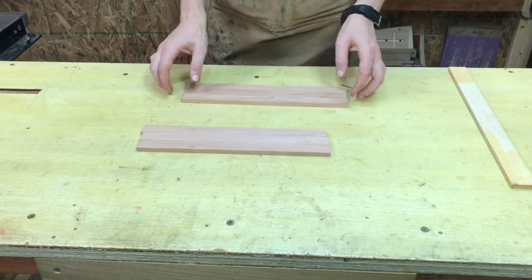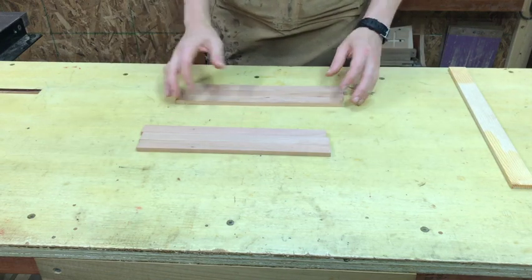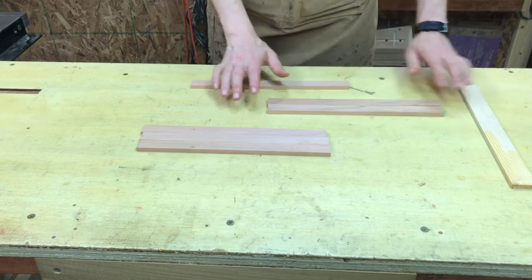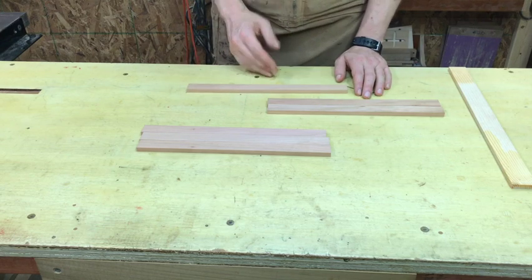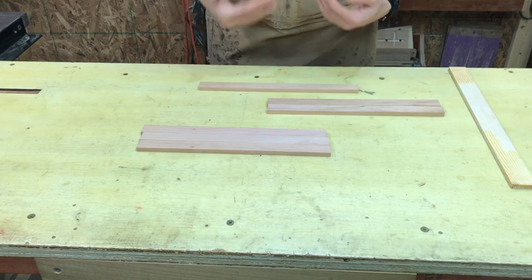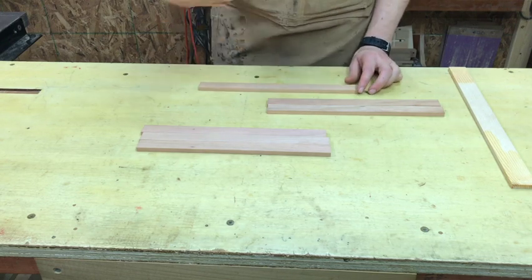Now, what I suggest doing here is leaving your walls, assuming this piece is relatively close to where you're going to work down to, leave the long walls staying there. We'll just cut the miters down, and then leave as much room as you can for these. I'm going to just split it in the middle. This is like 13. It's much safer, in my opinion, to nibble down doing the miters than to try to get this perfect and then miter it.